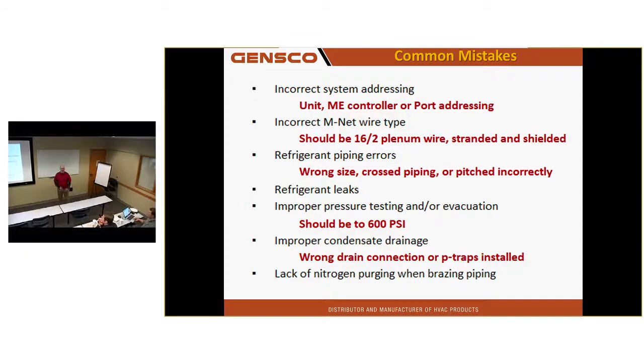We want these units pressure tested to 600 PSI. You guys do that already, right? On everything, right? You're hoping so? Don't some municipalities want to see the gauge showing 600 PSI? Like Seattle does, don't they? Bobby just wants to see the low side. The regulator doesn't go that high. Your gauge won't go that high? 525, that's not sufficient. We want to see 600 because this unit might operate at that pressure. Screwdriver. Can you get him a new gauge?